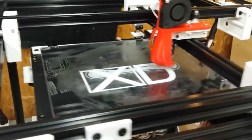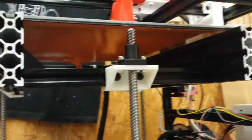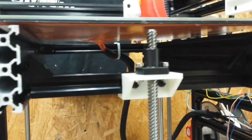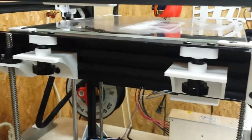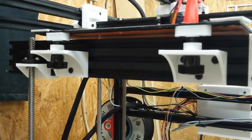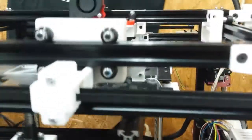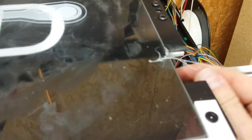The bed itself is heated. You can see the orange heater underneath the bed, and you can also see the lead screw — the near lead screw. There are three leveling points; they are attached to the under-frame. I have two on this side, and you can see the third leveling screw over here. That three-point support makes it quite easy to level the bed manually. I have not implemented any kind of auto leveling.